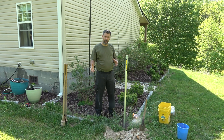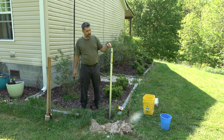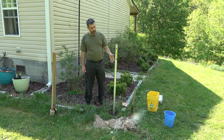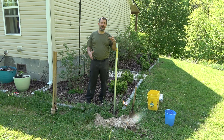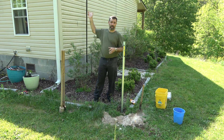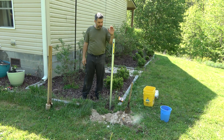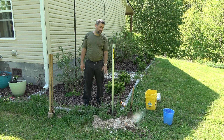You're going to need some stuff if you're following along with this and wanting to set up a system like this for yourself. This is an inch and a half pipe, or conduit. We picked this up at Home Depot or Lowe's, whatever home store is in your area, and it was a 10-foot section. I cut it down to six. You can have it lower or higher. The kit comes with a mount to mount it on the side of a building or on a roof, but I'm choosing to have a freestanding. It just works better for me. I've cut this down to six foot, and only two feet of that is in the ground.